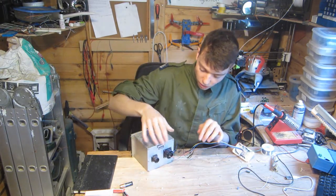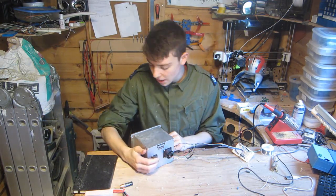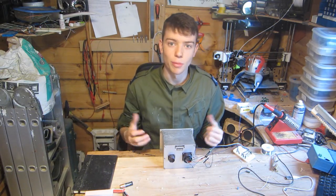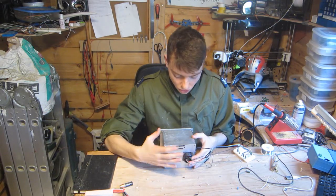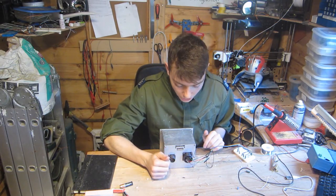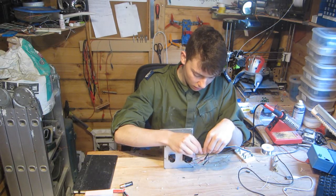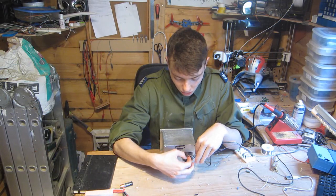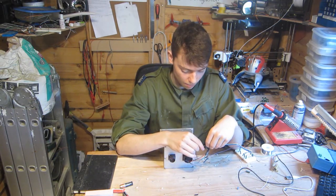So turning the unit around, we can see the rear plug. As we found, this plug here isn't connected. It probably was connected to the other controls that we found, but is no longer needed. This being the main connector, it has all of the connections we need. So all of these wires coming out the back are purely for the backlighting. So as you can see, we have the 2 different pairs. So these 2 are one of the systems, these 2 another one, and those 2 the others. I can't remember which one's which, but I have written them down.